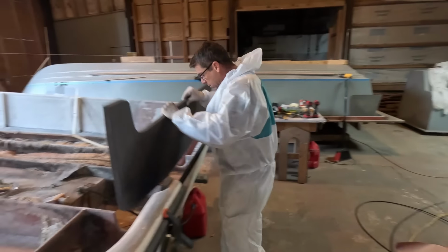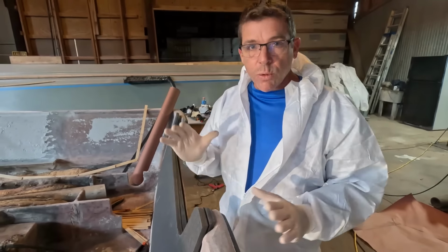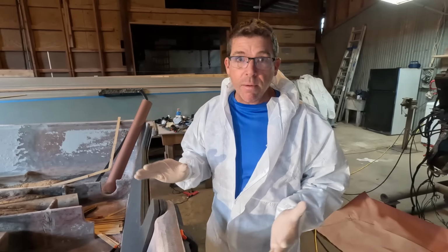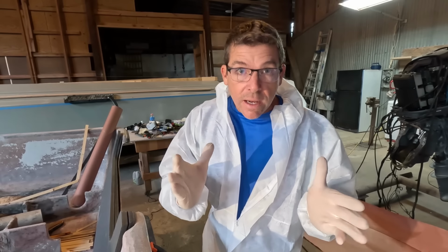And Coosa, a lot of people think that it's got to be fiberglass to have any strength, and that is just not true. You can actually put this down as a replacement, like on a pontoon boat, for example. You could pull the old plywood out, bolt the Coosa down, and you don't have to fiberglass it. Same goes if you've got an RV at home. Now, this is where I've had a lot of people that are finding the channel that didn't even think about RV application. So bad floor panels and slide outs and that kind of stuff. If you want something that's lightweight, very strong, can be screwed, bolted, works a lot like plywood, but is never gonna rot, Coosa is gonna be the answer for you.